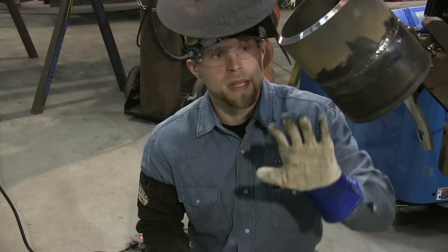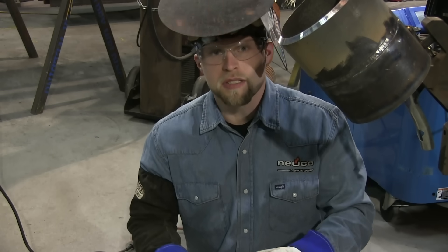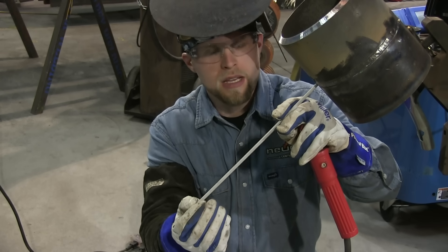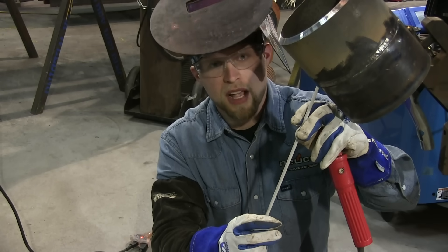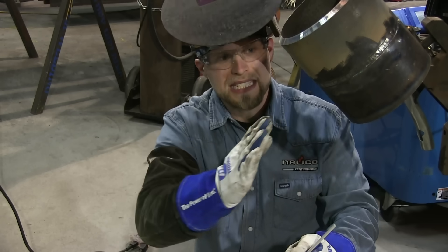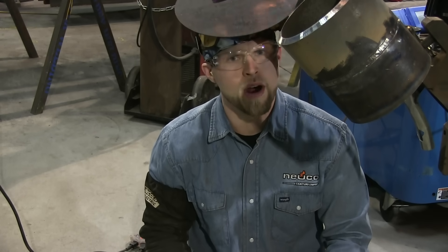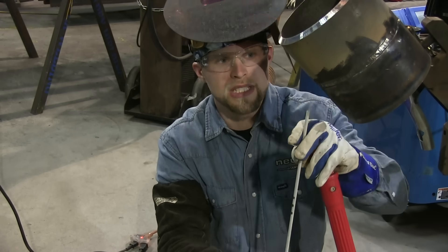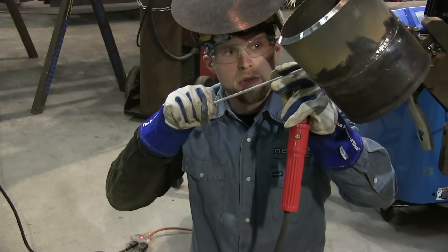A pro tip for when you're doing the bottom of your 6G, no matter if it's 4-inch, 6-inch, or 2-inch pipe: you'll see in magazines and articles to keep your rod 90 degrees around and 90 degrees pointing towards the center of the pipe as you go around. I agree with keeping 90 degrees as you go around, but on the bottom passes, angle your rod down — almost straight up — so you don't get that sag underneath the pipe. As you come around you'll straighten it back out, pointing 90 to the pipe and 90 to the center. That should help with that sag and dip issue on the bottom.